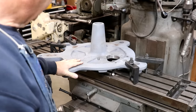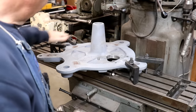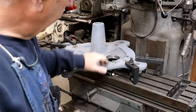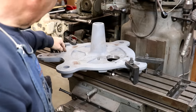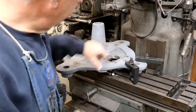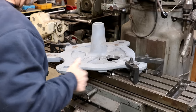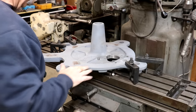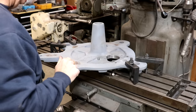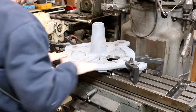To clamp this down, it's sitting on the center hub back here. Because this is all kind of cantilevered out, I went in and put some machinist jacks and just snugged them up in here. I've got four machinist jacks placed up underneath this, and we've got these clamped down on the ears. So it's sitting in five places — on the four machinist jacks plus the center hub. It's clamped down pretty good. I do want to take a minute and rig up some way to indicate off of this — I want to make sure we've got this thing sitting flat to the bottom surface here.